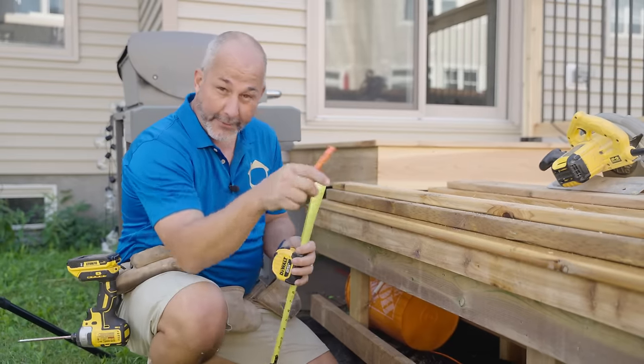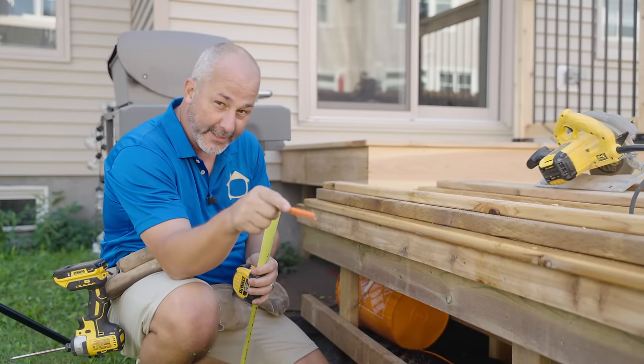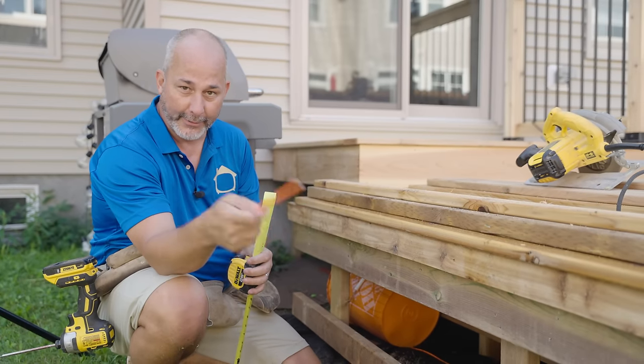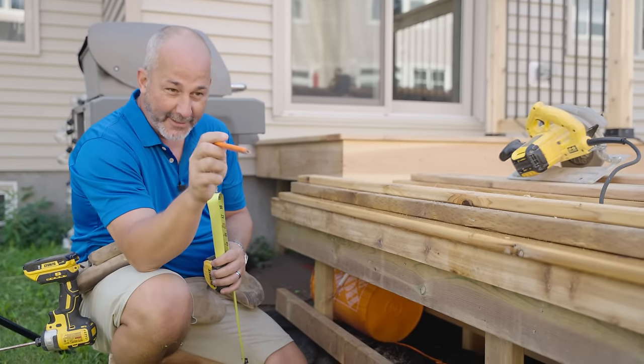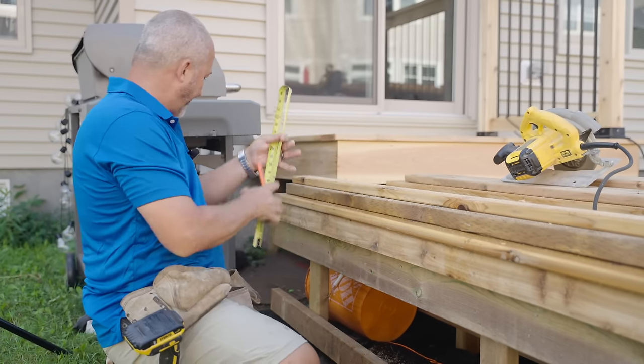Mostly because in that corner, the sun will come into that back corner and it'll melt the snow and then it'll freeze again. And we can get a freeze-thaw cycle, even if it's -5, which is 20 degrees in the States, okay? So that freeze-thaw cycle can wreak havoc with my deck. So that's why I gotta make sure I maintain a gap.